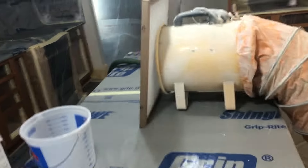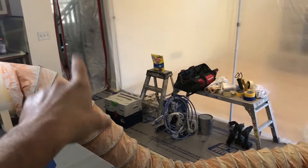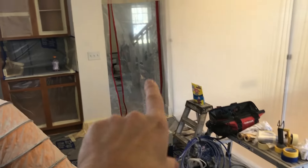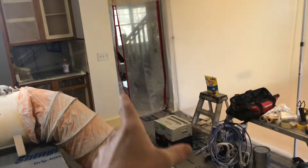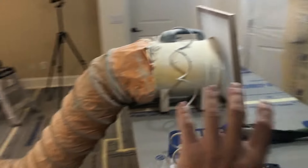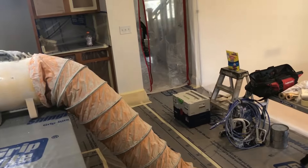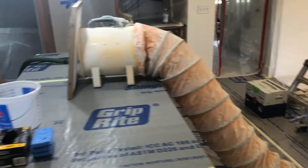It's important to have that plastic up not just to minimize cold air coming in, but so you don't get back pressure. When that fan is running, if you keep the door shut and you're sucking all the air out creating negative pressure it's going to put a lot of pressure on this wall. So when you have the fan on, have the door cracked a little bit — when we sand we seal it all up, but as soon as we start spraying we crack this door and the front door a little bit. That allows fresh air to come in while we get rid of the air, creating a negative air environment where dust and fumes get sucked out through the tube.